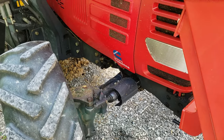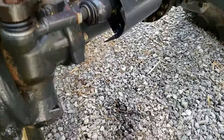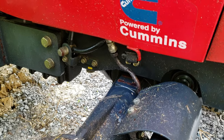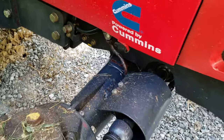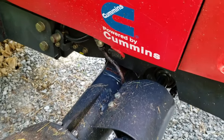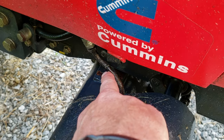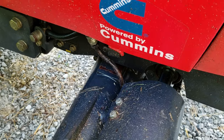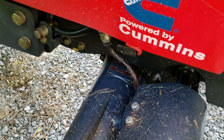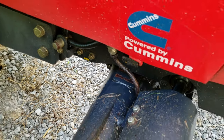This is my 2009 Branson 6530, and we blew a leak here in one of the power steering lines. It was just a drip, and then I did some bush hogging, and now it's an all-out, full-blown leak. You see this metal line here — somebody hodgepodge that and bent it all in there. They even brazed it, like soldered it. But it's supposed to be a steel flex line in there because that axle moves and your wheel turns in and out from the power steering.